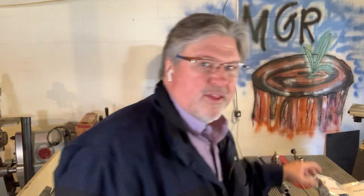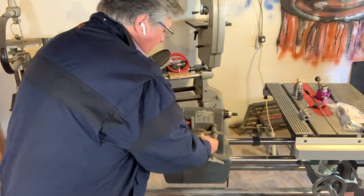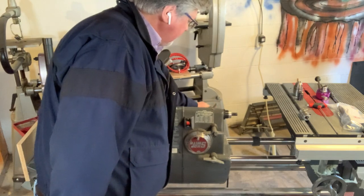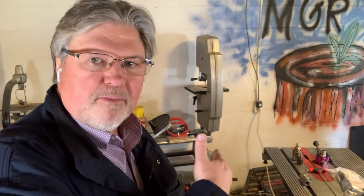When you're using your table saw, that quill lever has to be somewhere. I've been in the habit forever of keeping that lever on the back side of the headstock. That way it's never in the way of my speed dial when I'm changing speeds on my Mark V. When I raise the machine up into the drill press position, that puts it on the right-hand side, which is where I'm going to use it. And even if I'm using it on the table saw to move the saw blade just a bit, I can reach over the headstock and do it. So I've never had a problem with the stock quill lever, except it can be short for mortising and those three positions may not be the exact position you want.